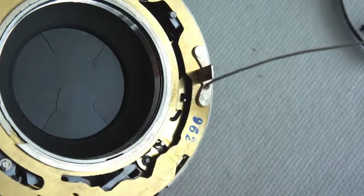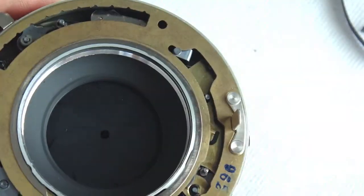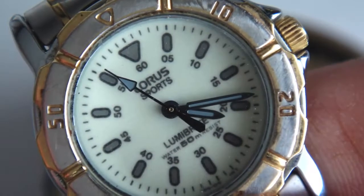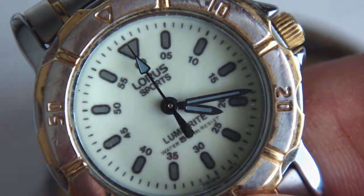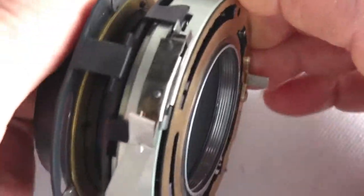This particular escapement does not usually have lubricant in it, so what we're going to do is flush clean it with alcohol, tipping the lens in such a position so that the alcohol drains away via gravity away from the shutter blades. Once this is done thoroughly, let the lens set for 24 hours. If the flushing procedure went well, the next day the shutter speeds will work perfectly. Otherwise, do it again.